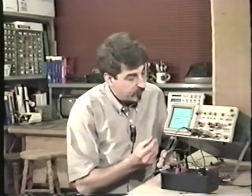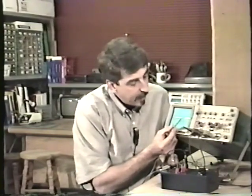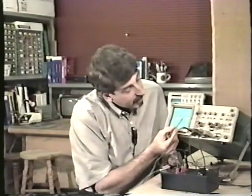And again, instead of multiplying it out, just count it out. It's 20 microseconds per division. So 20, 40, 60, 80. Well, halfway through would be another 10. It would be 90, actually. I was wrong when I calculated it in my head, wasn't I? Halfway would be 90, and it's a little bit more than that, 92 or whatever it is. And that's really as close as you have to get.